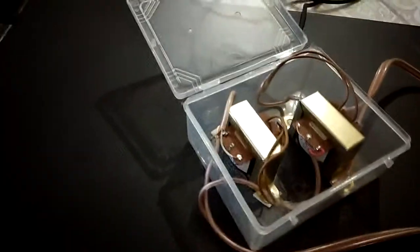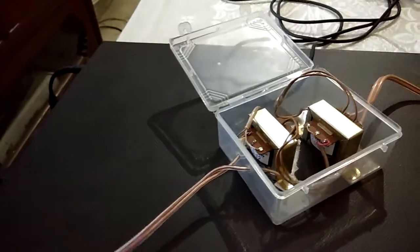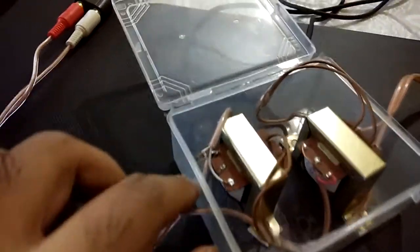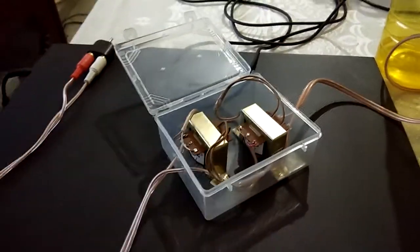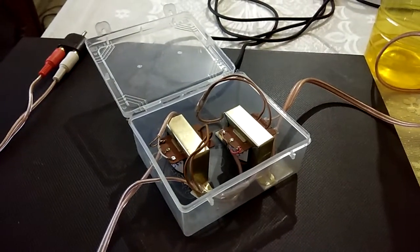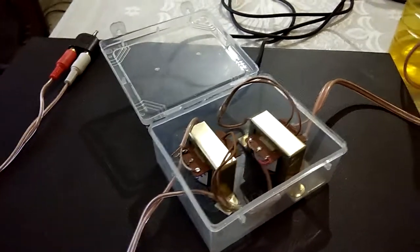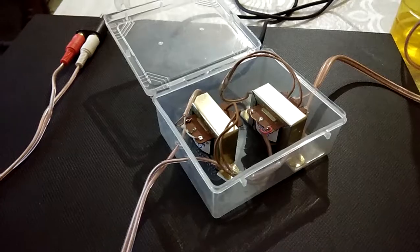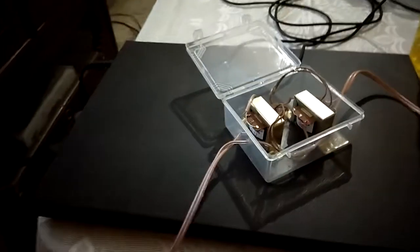What I've made basically is a homemade audio noise filter — it's a ground loop isolator. The concept is: there are two cables, one input coming from the television set, which goes through a transformer. These two transformers are very cheap ones available in the market. I bought them in India from a local dealer for 30 rupees each. The cables also cost around 30 to 40 rupees per cable, which I split into two parts.